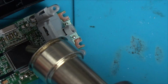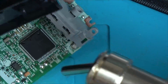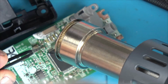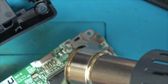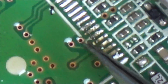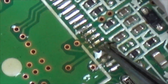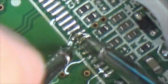So whenever you've got 1 second of footage, you know that you've got a problem. Anyway, so what happened was I put the phone on the charger, and although it was showing full, after a little while it then started to charge, and it was weird. It went down to 1 bar then started to charge all the way up. I left it for a couple of hours, and when I looked back at it, it had no display, and I could not get the display back. So every single time I took the batteries out and put them back in, I'd get the beeps off the phone, or every time I put it on the charging dock, I'd get the beeps, but nothing was displaying, so you couldn't see the numbers you were ringing.